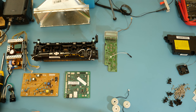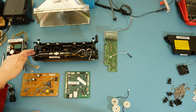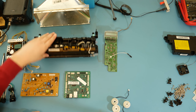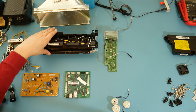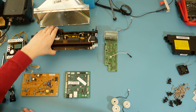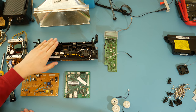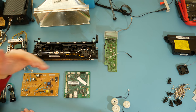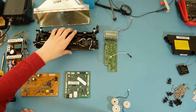And when I think about the way that it worked, the lights would dim when it would click on this heating element. It would heat for a little bit, and this mechanism would spin while it was heating. So it could be some sort of heater, and then spreading the heat around with the rollers where it's evenly heating the rollers. Could be doing something like that. Yeah. Maybe we'll have to dig into this a little more. I don't think there's anything exciting in here. I think there's going to be a heating element, some gears, and this thermal cutout, but it is incredibly heavy.